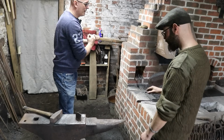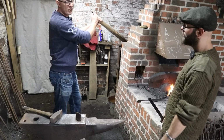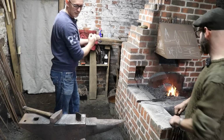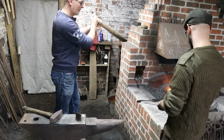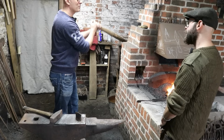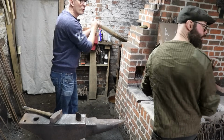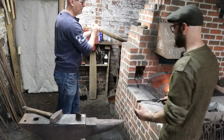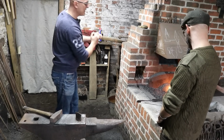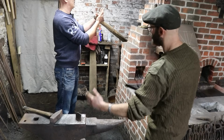And we want 4 inches. So we're going to leave the blade about 4 inches long, because when we forge it out into a point, it's going to turn into, let's say, 6 inches. Presumably this needs to be pretty hot to cut properly. Orange, red to orange. Okay, so normal forging. Yeah, we are essentially just forging a groove into it. This is pretty much how fullers were made. Exactly. This is a fuller that's got a sharp point to it.